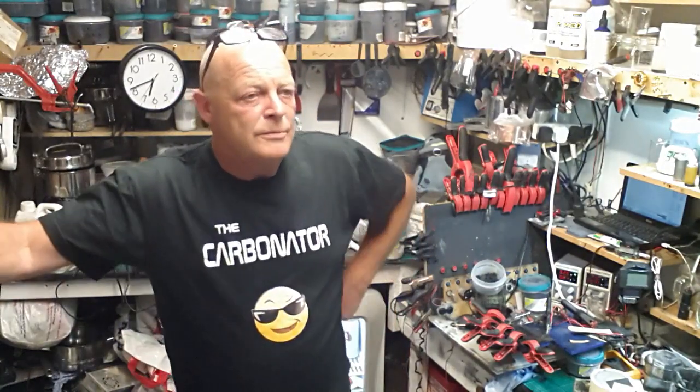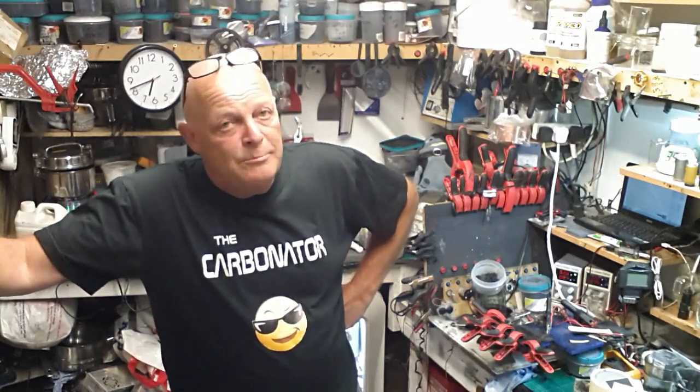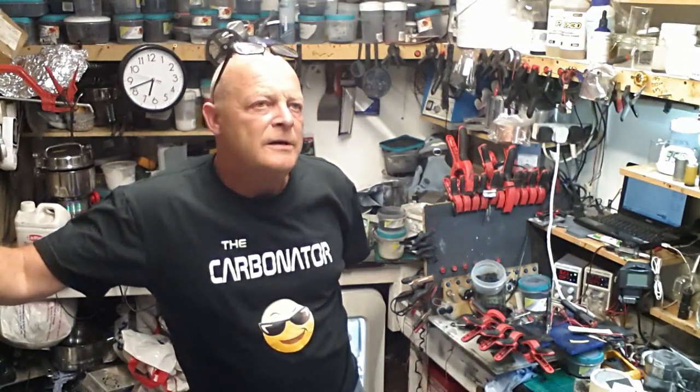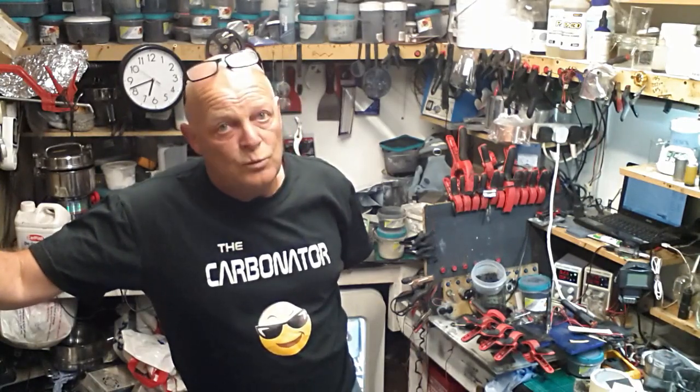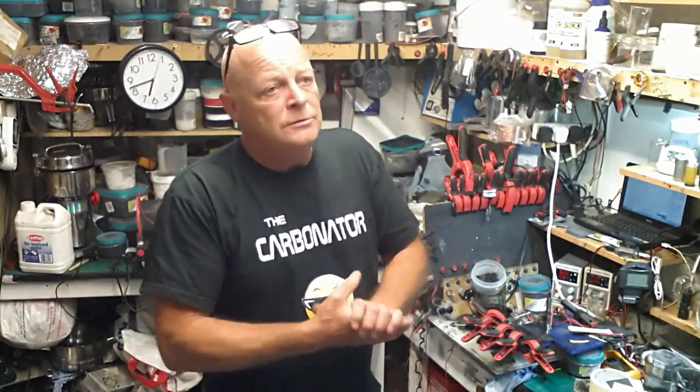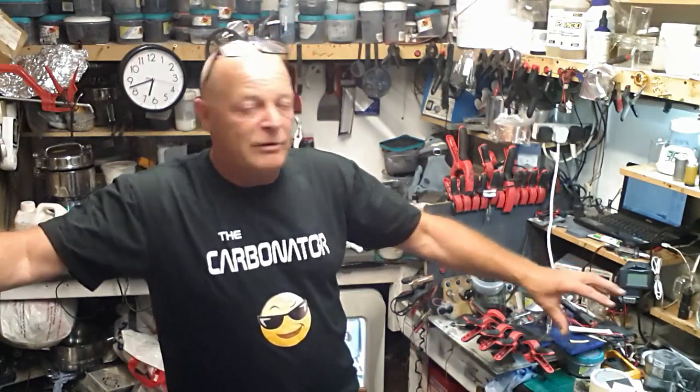My electrolyte was a zinc iodine based electrolyte, like I said, which is what I've been using for quite a while now. But it was a new take on it, propylene glycol based, 20% water, zinc sulfate and some iodine, and a little bit of choline chloride. So that was what I was working on, and I'd kind of almost got there with it. There was absolutely no outgassing, even at 3.2 volts with that one. So when I got back, Tony mentioned how well this other electrolyte of Pete's worked, or was working. Now he tweaked it. It was working well anyway, but he's tweaked it and it's working even better. So that's great. Haven't even told Pete yet.